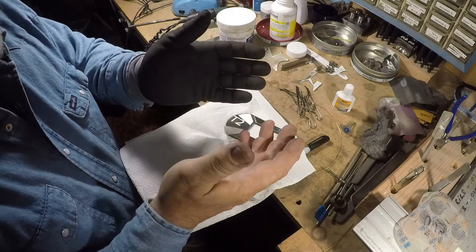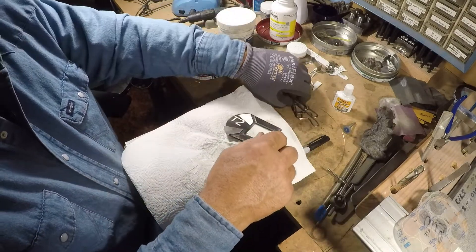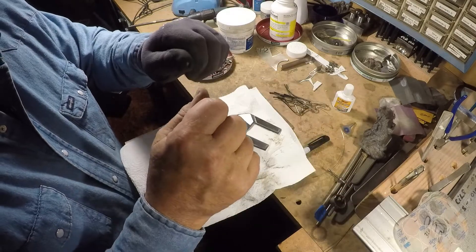Spurs are the same way — you hold them up there with that clamp I showed you, all clamped out. Your spurs are going to be curved so you've got to form it better and may have to use more clamps to keep it all on there. A lot of times I soft solder the overlays on spurs — I've never had any come off with no problems. I do a lot of inlay on my spurs where I don't solder at all, but when I do solder I usually use 430 solder. You don't have to get the steel as hot and you can use cool gel in some areas. Since I'm not getting it as hot I'll use a spring-type clamp, which is a little easier on spurs to hold multiple pieces in place.